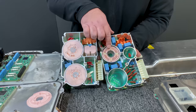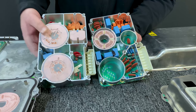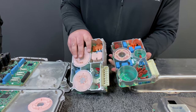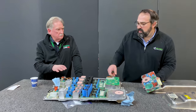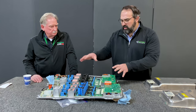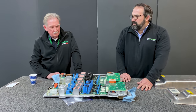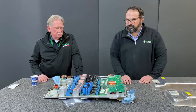These coils are about three-eighths of an inch smaller in diameter than on the Model Y, so there's quite a bit of weight difference. They've cut out a lot of weight by reducing the coil count, and cut the height as well, allowing shorter screws and different things with the housing cover. The weight differential is about 1.2 kilograms from this entire setup — savings going from the Y to the S — and we've added about 16 kilograms overall. For those not thinking in kilograms, that's less than three pounds of savings.